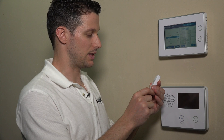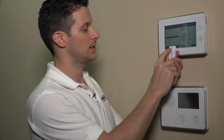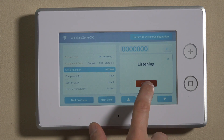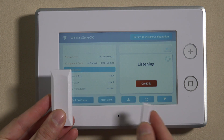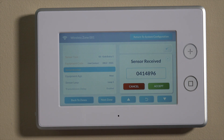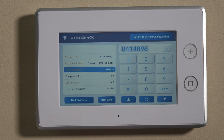There are two ways to enroll the serial number on any wireless device. One is to manually enter it using the serial number listed inside the unit — it's also listed on the back side as the TXID, for example 041-4896, in the format of three numbers, dash, four numbers. To avoid manual entry errors, we can hit the learn function — it'll say 'listening.' Now take your sensor, move it away, and bring it back. The panel will say 'sensor received,' and the seven-digit serial number matching the TXID on the back will populate. Hit accept to lock that in.